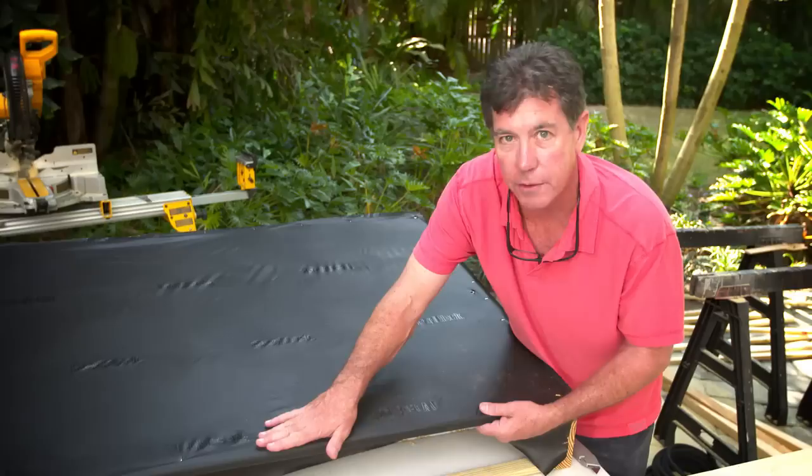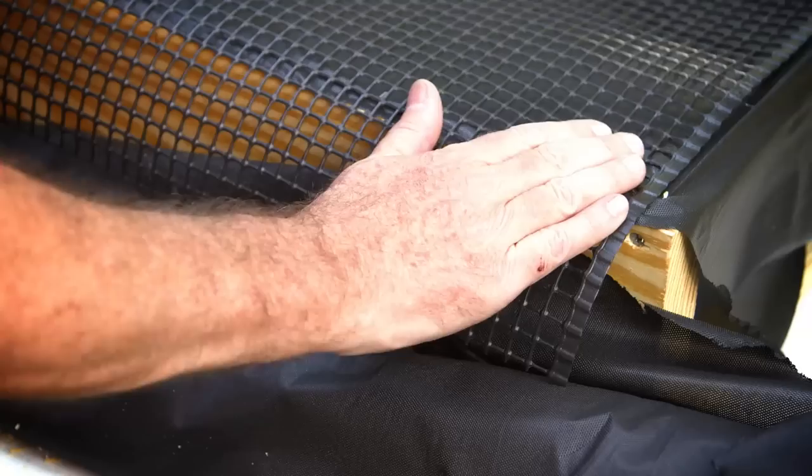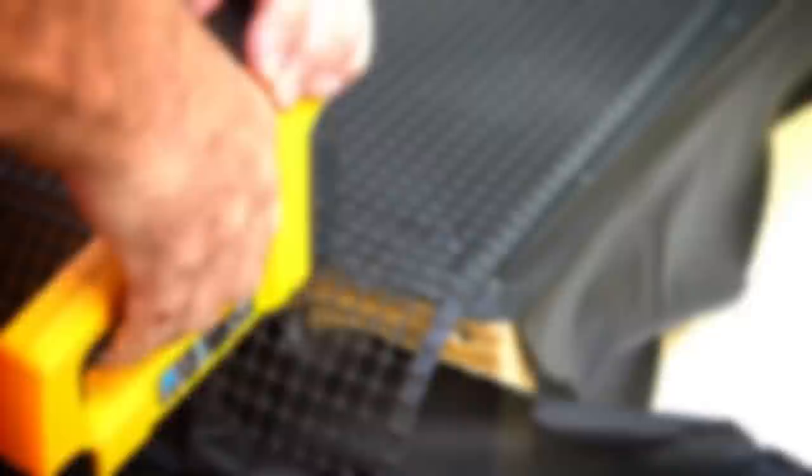Here's our cloth that we need for this — basically the chicken wire. I'm going to stretch it across and it's going to give us a little more rigidity to the whole project. What I want to do here is tack one side down then go over there and make sure that other side's down, because if this isn't right we're going to have all kinds of problems. What's going to be nice is that the lattice screwing into this will really help hold this in place. That's on there pretty good — a little trimming and we are off to the races with that one.